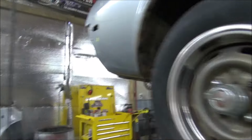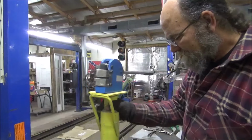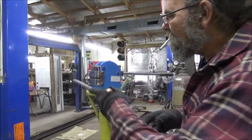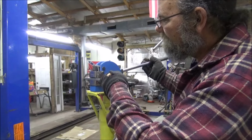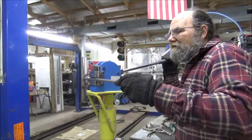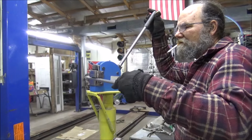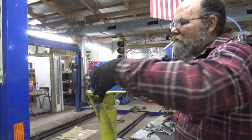All right, back over here. Now we're going to pull out the shrinker stretcher. And of course I have the shrinker one in here. What I'll do, I'll start at the dot, the smallest one, and I'll just give it a little bit. A little bit. Now I'll start getting more aggressive with it.